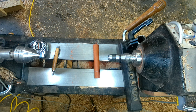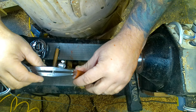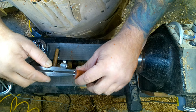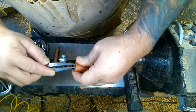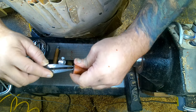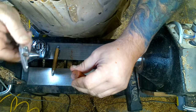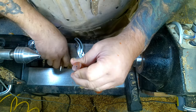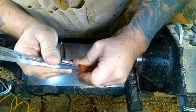That should be close enough. This doesn't have to be exact, but when you're doing multi-axis, one of the things you need to consider is that the further out from the center your secondary axes are, the more extreme your deflection for your off-center turning. And this is a pencil or a pen, so we really don't want it to be wild. So that's my first point — it still has to fit in the kit and be held in the hand.